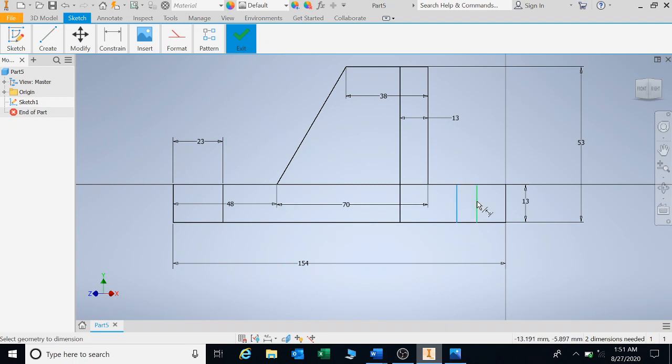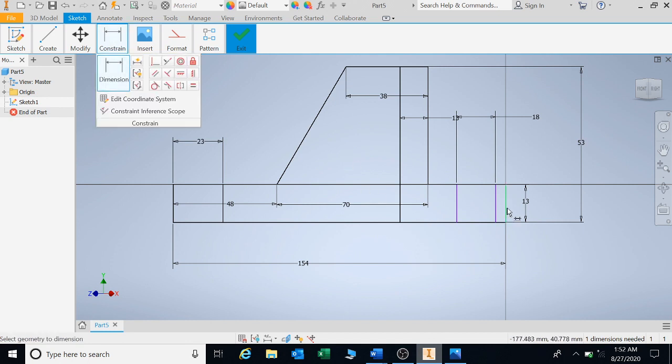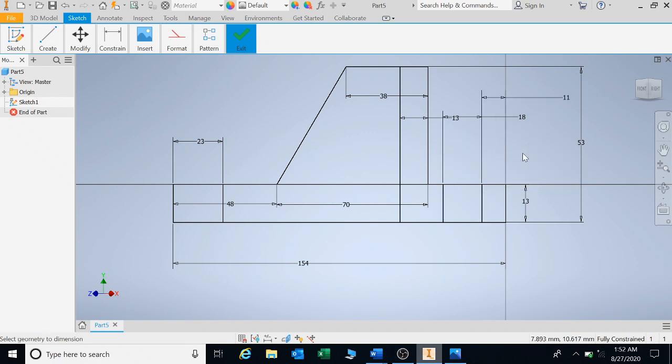The hole size here is 18 millimeters — it's all elongated, 18 millimeters of length. But I need to know the distance from this edge from there to there. We have 18 millimeters, and the radius from this point to there is 20. We also have a radius there of 9 — from that point to there it's 9, because that's 18, so the radius is 9. So that width is 11. Typing in 11, and we are ready for double extrude.